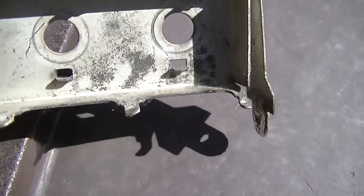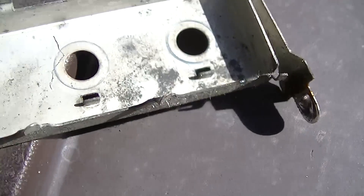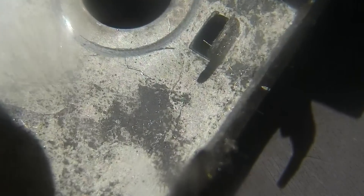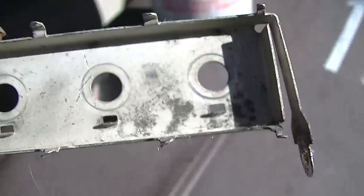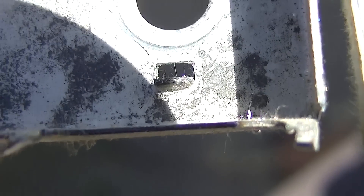If you look at the bottom, there are literally thousands of them. See that one right there? It's sticking down — see it's shiny, about right in the middle of the screen? It's sticking down, but there's a bunch of them sticking up, and what they do is they short out the pot. This is the AGC and vertical. You can see one there sticking straight up.